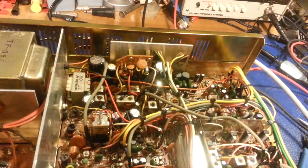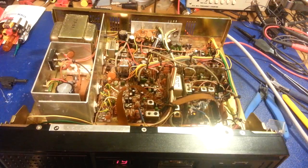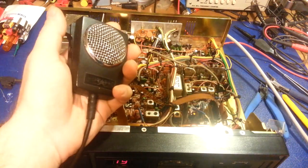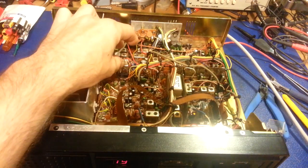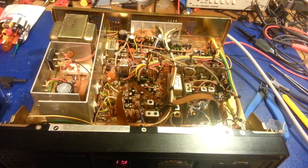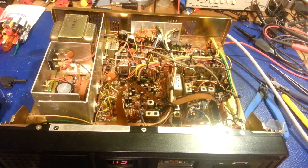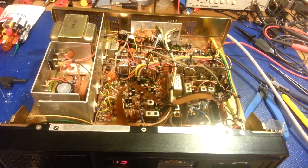It's this contact over here, and that's the one that switches the antenna lead. So if you ever have weird and intermittent problems with a radio, the easy way — without even removing the cover — to see if you have a relay switching radio is key the microphone. If you hear click, click, click, you've got a relay. First thing to do: try and take it apart, run a piece of paper through the contacts to try and burnish them a little bit. Don't use anything abrasive — paper is perfectly abrasive, it'll polish it a little bit. I tried that on this one and it's still intermittent.